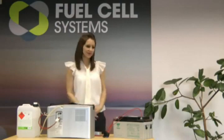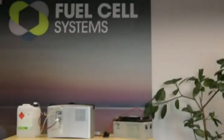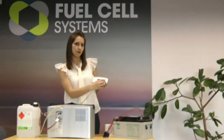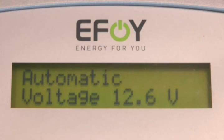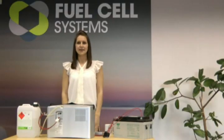We'll go and have that mug of tea while it starts, shall we? OK, we've made our cuppa. Let's have a look at the power we're producing. If we take a look at the display, it shows us a number of data items. By pressing this button here, we can page through the data. The top line is showing that we're in automatic charge mode. Most users keep it that way. The lower line shows us the battery charge level — here, it's 12.6 volts. If we press the button again, it shows that the unit is currently delivering a charge of 5 amps to the battery. And that's it. Clean, straightforward and easy, and a boon for anyone who needs clean, quiet power off-grid. Thanks for watching.